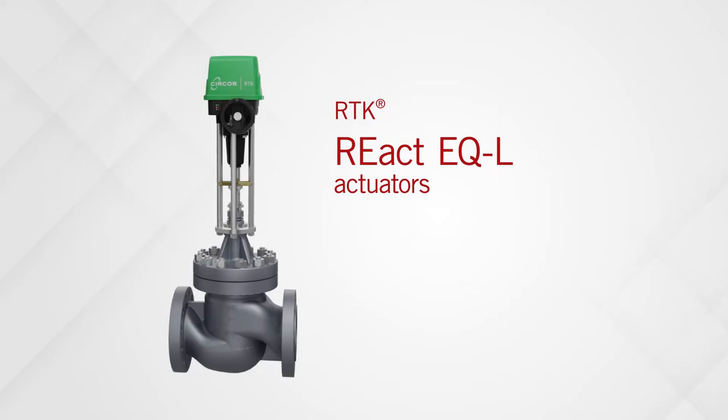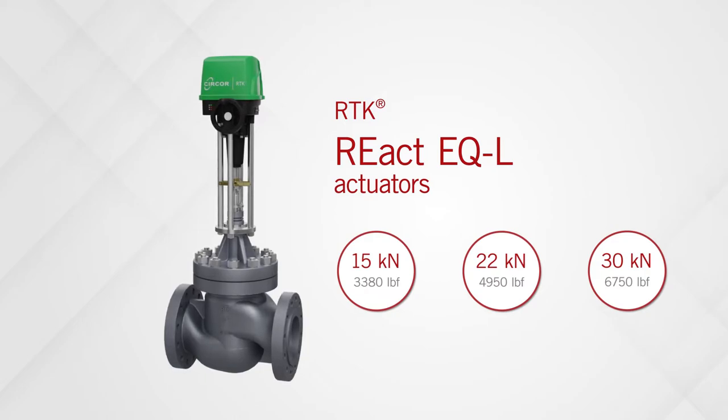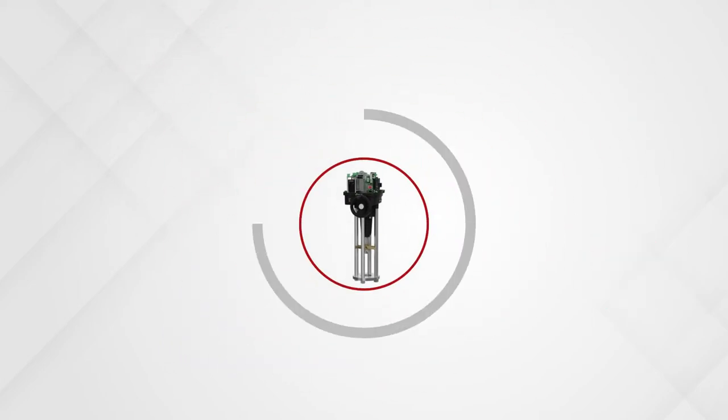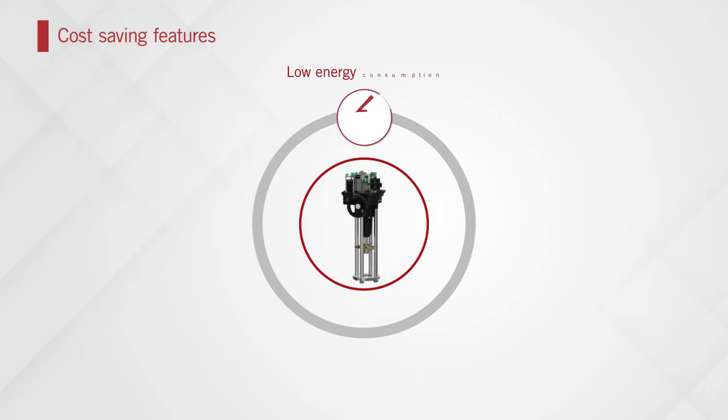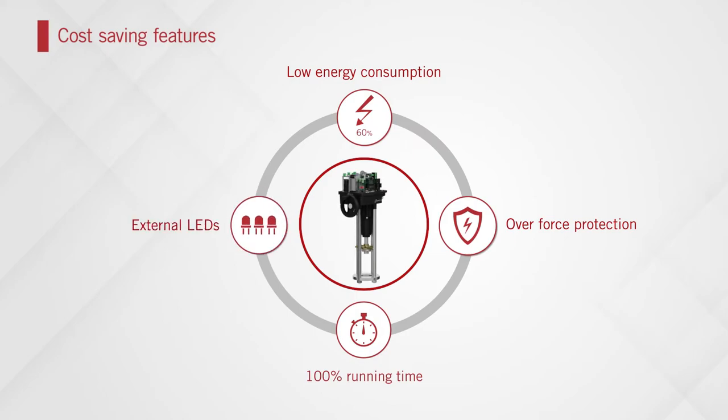The RTK REact EQ-L series provides higher actuating forces from 15 kilonewtons to 30 kilonewtons, while giving plant operators the same system-protecting functions, convenient features, and efficient performance. RTK REact EQ-L actuators come with cost-saving features like reduced energy consumption as compared to synchronous motor actuators, overforce protection to prevent damage, more efficient due to 100% running time, and external LEDs indicating actuating direction for easy monitoring.